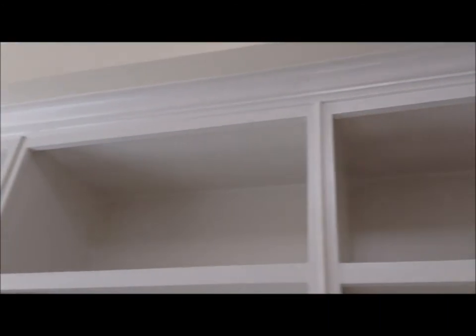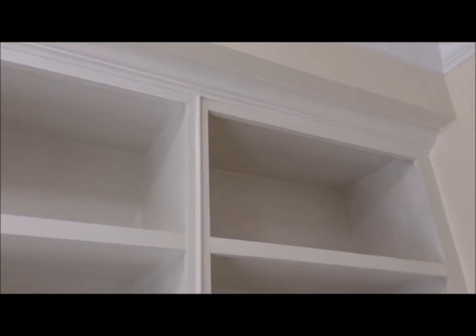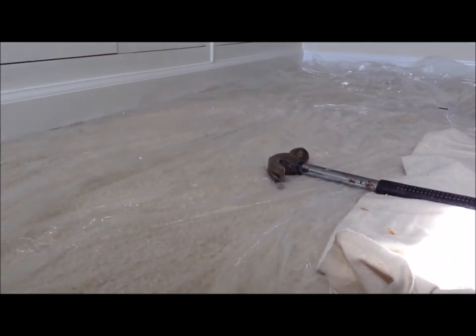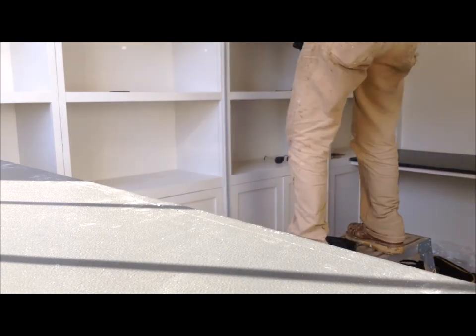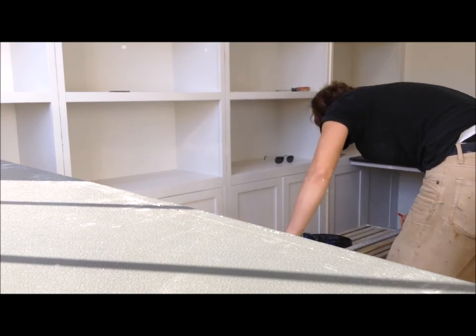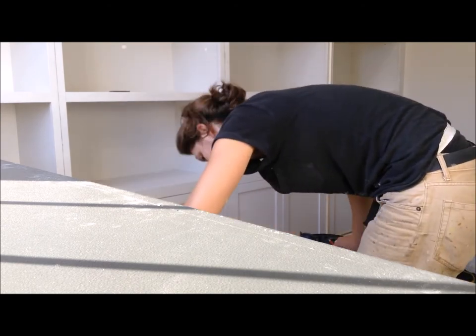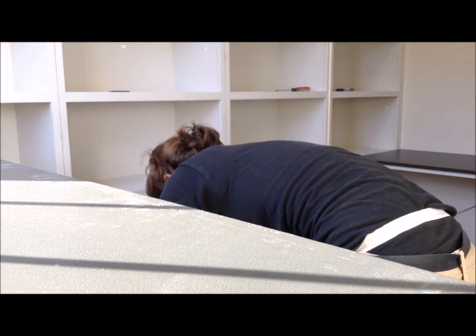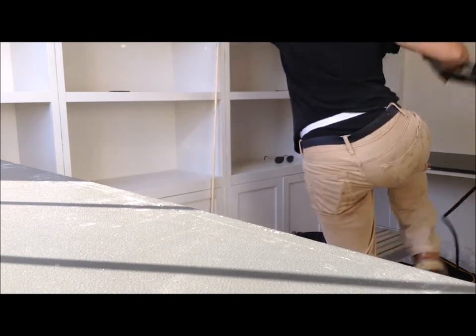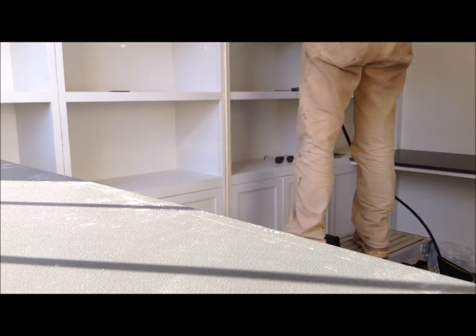With all the cases in place, I cut a piece of crown molding for the top, and cut and coped a piece of molding for the bottom. Those cases sit right up to the edge of the base, so the molding covers the base and you can nail right into it. Because the built-in was designed to be taken apart, there's a seam where all the cases meet. To cover that seam and add some style, I used some thin half inch round-over molding, cut them, placed them between the seams, and attached them with brads — they'd be painted later to match the built-in.